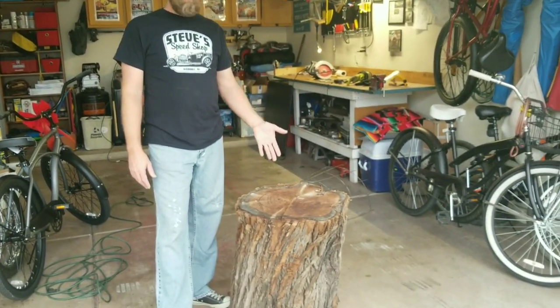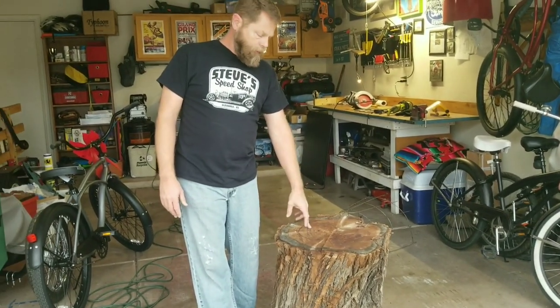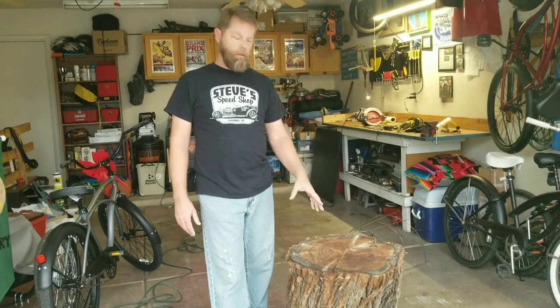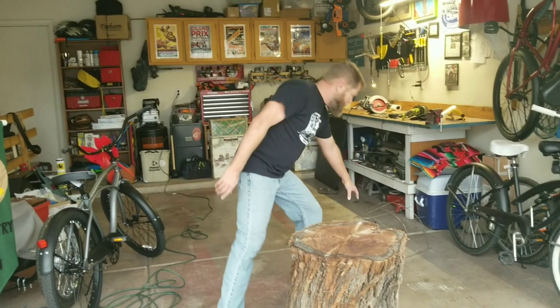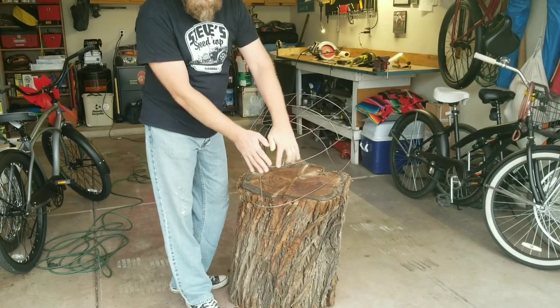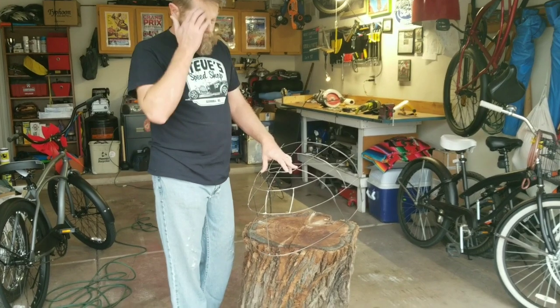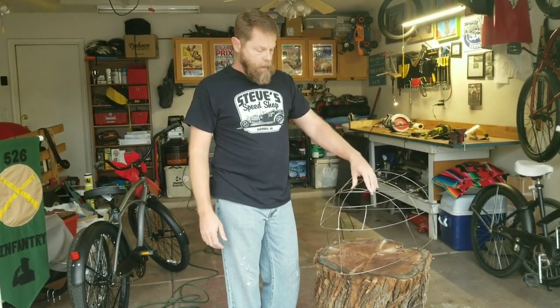Hey, thanks for joining and tuning into our channel. Normally we do cycle carts and today's kind of a cycle cart related video. We're going to make a shrinking stump — some people call it different things — but it's basically a stump we're going to dish a hole into, like a bowl-shaped hole, using a circular saw. That's going to allow us to shrink aluminum or steel to make the complex shapes we see in cycle cart tails. I was at Ed Smith's shop with Engineering; he had a shrinking stump that worked really well and I decided I wanted one for home.